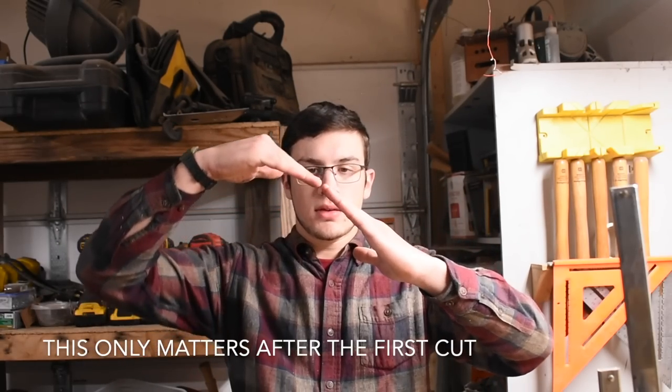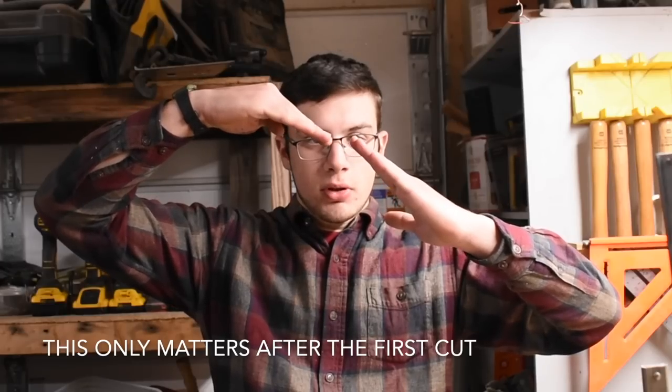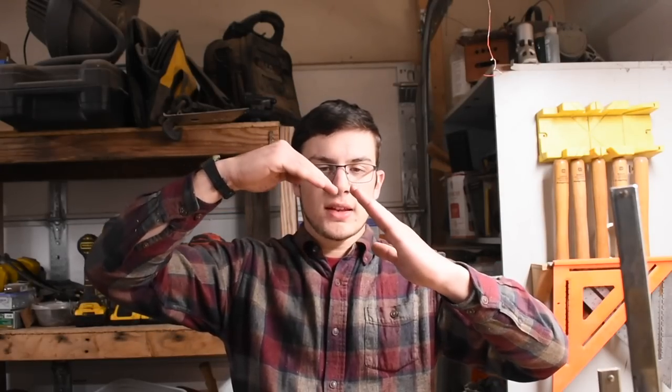And it's like a quarter inch thick. So then you have these lines and then you cut it and then you pull them over, so they don't line up anymore. What you have to do is remove the thickness of the piece you're putting in. So you're cutting off that area so it moves your lines so they're straight. So I'm going to try to make one, but I'm going to remove the thickness of the piece of wood I'm putting in. So it will eliminate that factor and hopefully look a lot better.